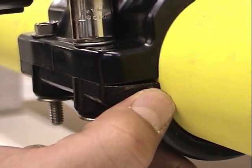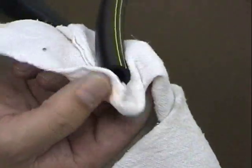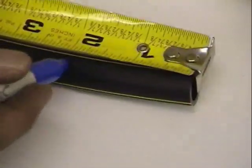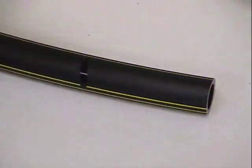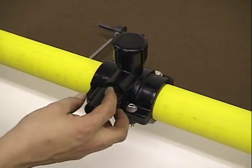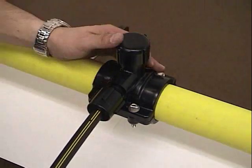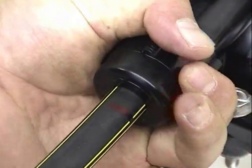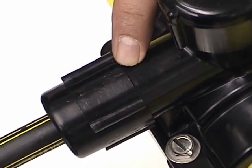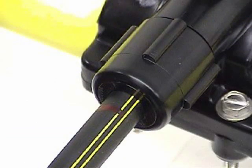Make sure the outer edges of the top and bottom flanges meet. It is not necessary for the inner edges of the upper and lower flanges to meet flush against each other. Before you install the pipe in the outlet, make sure it's the correct size. Make sure the pipe end is clean, free of grease and dirt, and cut square. After cutting the pipe end square, measure and mark the proper stab length according to the instructions on the bag. Loosen the compression nut until the seal ring is no longer compressed. Insert the pipe until it bottoms in the outlet. Turn the compression nut hand tight, then use a wrench until it shoulders against the outlet and there is no gap. Do not over-tighten. The line marked for the stab depth should be no more than three-quarters of an inch from the face of the compression nut.